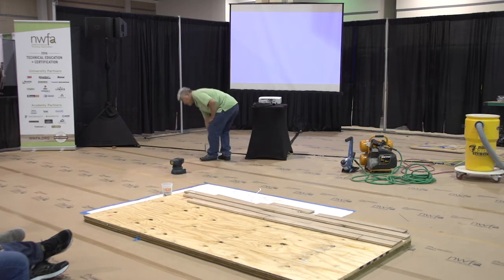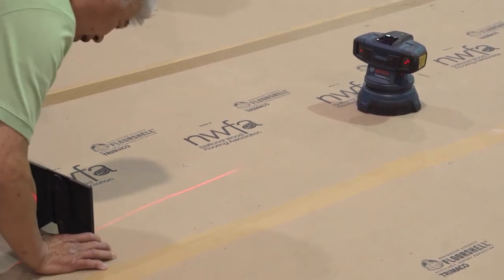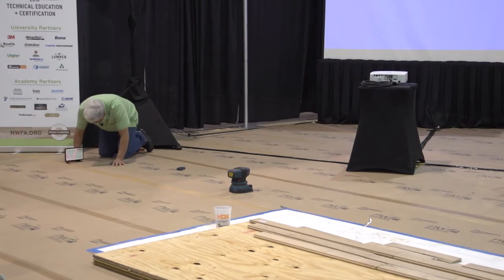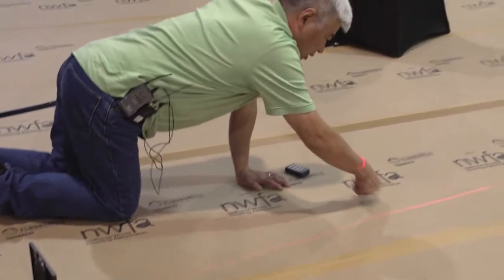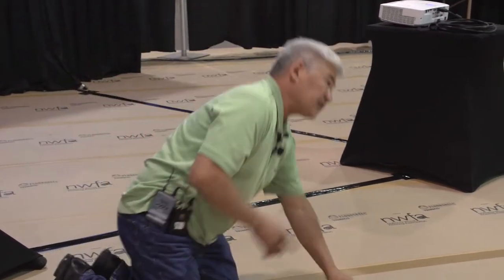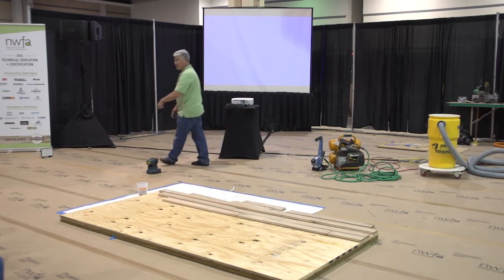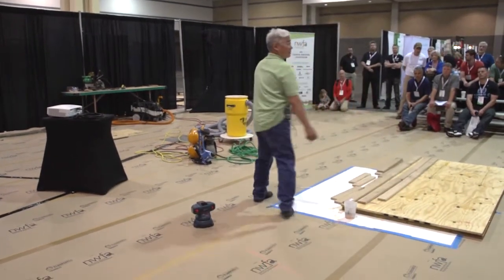Right here the beam is open. The beam is together right here, it's opened about three-eighths of an inch, and it's back together right here. If I line this up and set it, I'm about an eighth of an inch high right here. The beam comes together right here and separates again — I am about just a little over an eighth of an inch out. All I've got to do is get a pencil, mark out what it is, and determine: do I meet my 10-foot tolerance — three-sixteenths in 10 feet? Because the guidelines say quarter inch in 10-foot radius. One guy walking the floor, marking it — and it looks cool.